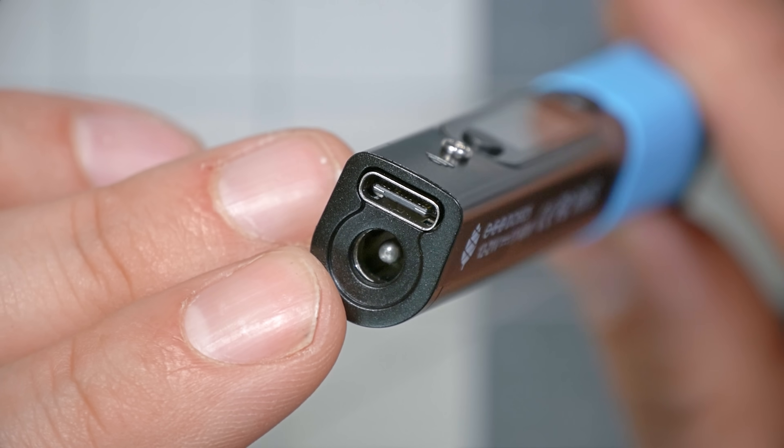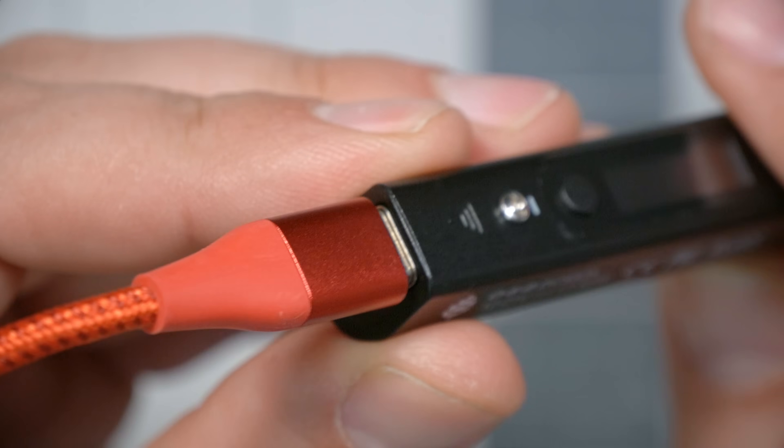This is the feature that made me look for a replacement for my TS-100. The TS-100, and most soldering irons like it, are powered from a barrel plug. You plug it into a battery, an XT-60, or into a wall charger. Mine got loose — as you're moving it around soldering, I guess it got tugged — and it kept turning off while I was soldering. I looked at the TS-80 soldering iron, which is also a very good soldering iron. It's powered from USB-C, and USB-C connectors are quite good and very secure. But there are two reasons why I didn't choose it and don't recommend it.